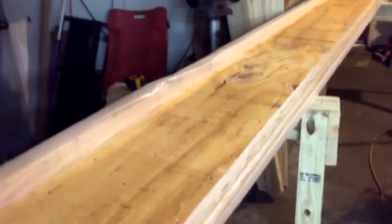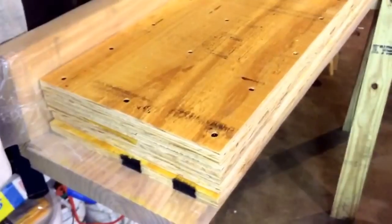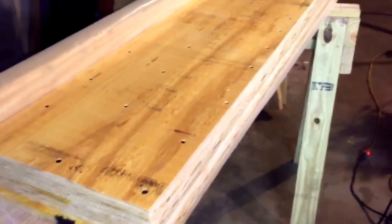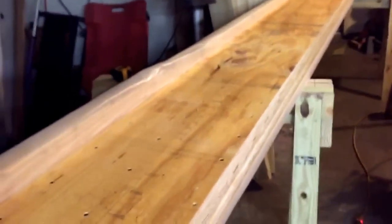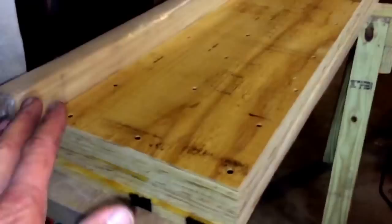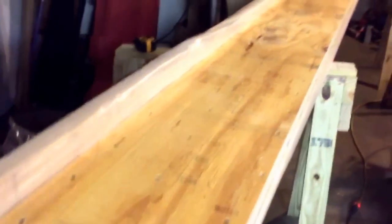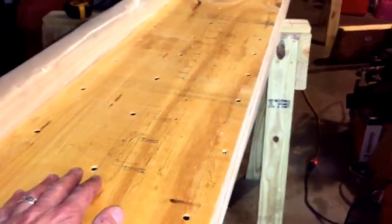We're building our beam right now. These beams are quite costly to buy. This particular beam will be 16 feet long. Originally it was going to be 5 and 3/4 inches thick. I've got it sitting in a form made of 2x8 and 2x12 covered in wax paper, just to keep the beam relatively square and formed up, and not have it stick to the wood with the excess glue we're using. This thing is significantly excessive for the application.